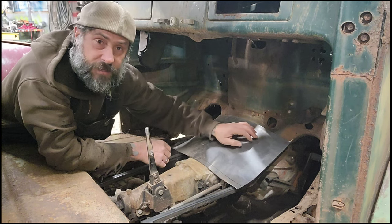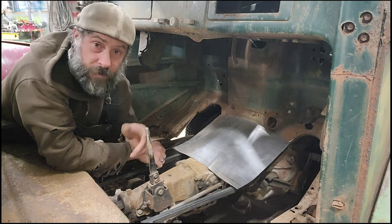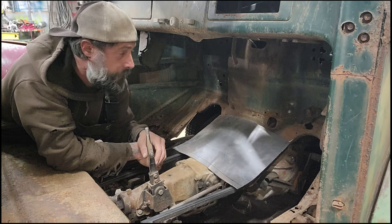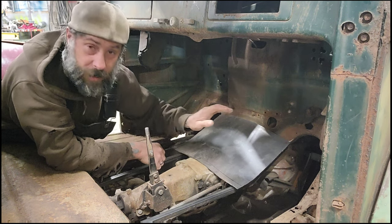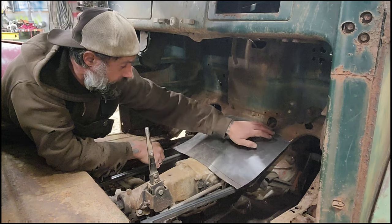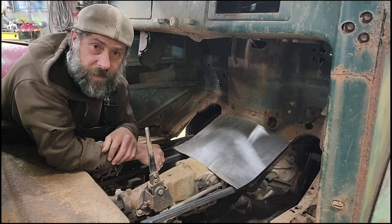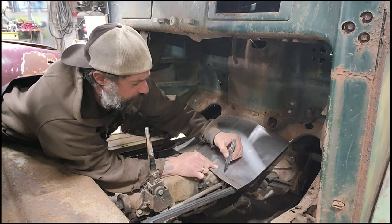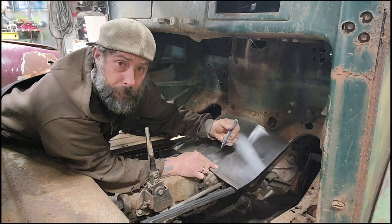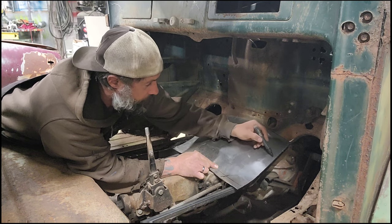The biggest thing I'm trying to do right now is put as little hump as I possibly can, because I am making this truck standard and four speed. So I have a clutch pedal, a brake pedal, and a gas pedal that I need to fit, and these trucks are very narrow. I got to be able to fit all those pedals in here — I don't want a gas pedal sitting on a big hump. So we're going to make the marks real quick and then start getting it in the English wheel and rolling it out. I also made this piece wider than it needs to be just to make sure that when I bend it up I have enough metal left to sit on my braces.